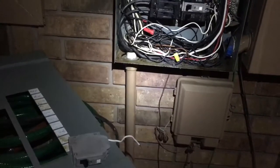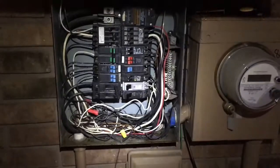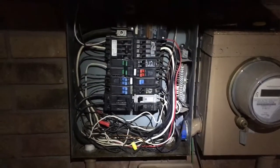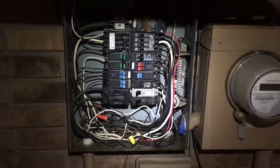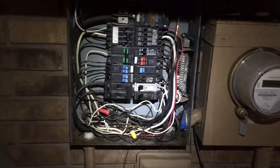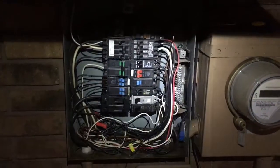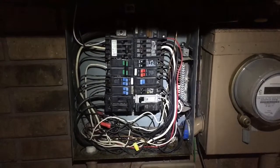This literally took me about 30 seconds to a minute. It threw me off a little that it was a GFCI-style breaker — I wasn't expecting that. I was just expecting one wire and then I found two, but that was just an extra little added bonus. Having a GFCI breaker when it probably has actual GFCI outlets downstream as well is really overkill, and it's obviously not a code requirement because they're not all GFCI breakers.